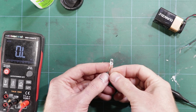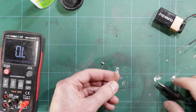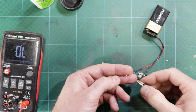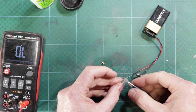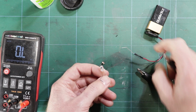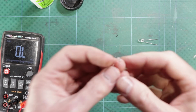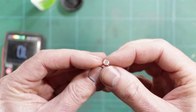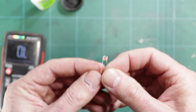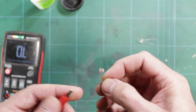Now, I'm not really sure what's in the original Vactrols. I assume they're just basic red low output LEDs. For this project though, I've been messing around with these nice bright sort of modern water clear red LEDs. These are rated at 3800 mcd and their forward voltage is 2.1 volts. The LDRs, light dependent resistors, I just picked these up at a local electronics shop, and these are rated at 5 k ohms light resistance and 500 k ohms plus for dark resistance.